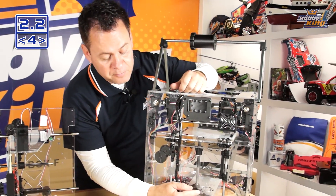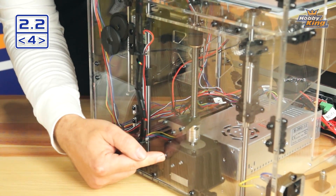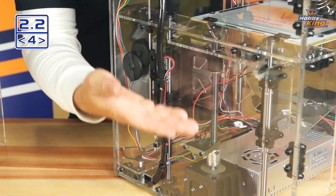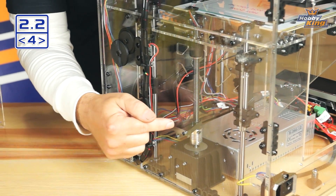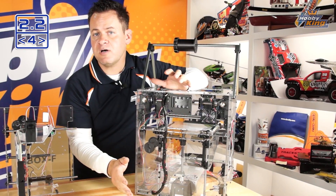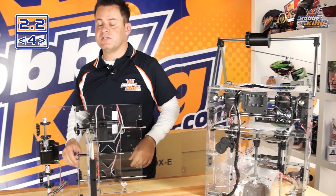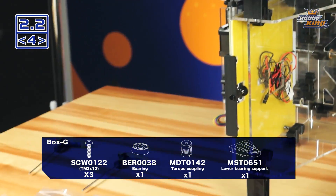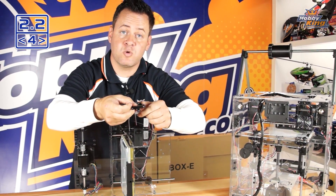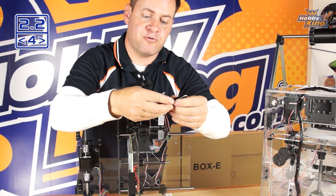In this step we're installing the support component for the Z-axis lead screw. It has a collar that attaches to our lower base Z-axis motor, which turns the lead screw and allows the print platform to move up and down. This bracket has a bearing in it that we need to install with a slight preload. The lower bracket has a small T shape with the center toward the bottom. From the top side, install the bearing — it's a press fit by hand and snaps right in.